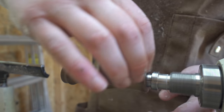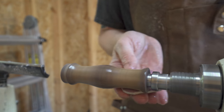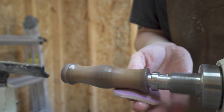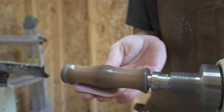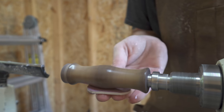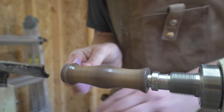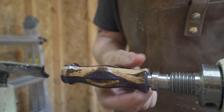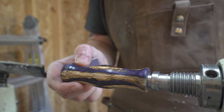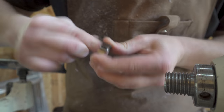This micro mesh up to 12,000 grit on a CA glue finish gives an awesome glass-like appearance once finished. It is extremely glossy without any other processes on its own, and once you head over to polishing it just pops and becomes this amazingly beautiful high gloss finish that's extremely durable.